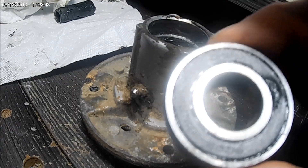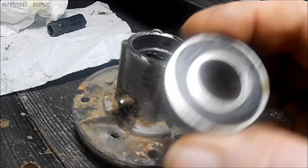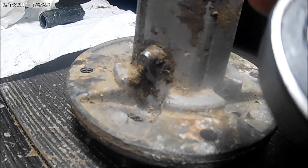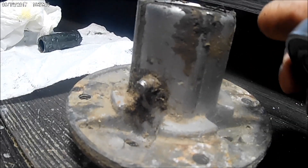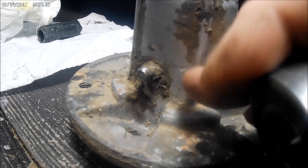The grease gun has tremendous hydraulic pressure. I told people before that the pressure from a grease gun is probably going to override that little seal and push grease in around the edges. I've done it before and it quietens them down. You get noisy quills with probably bad bearings, but you squirt some grease in there and that'll prolong having to take it apart and fix or replace the whole thing.